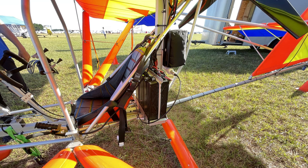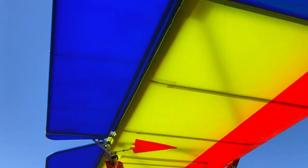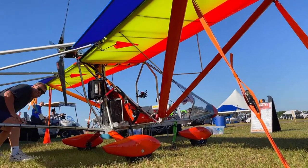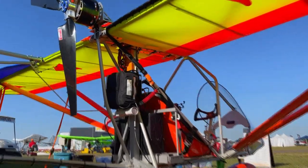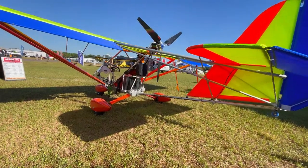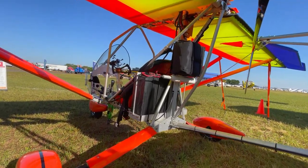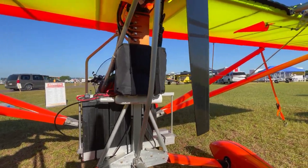We call them battery packs. There are three battery packs down there now. You can see there's a little space on one side — those are just some aluminum blocks holding space, because we took one battery pack out so everybody could see it rather than ducking underneath the airplane. The packs have a top bracket and they just sort of slide down in. All the plugs are up on top — kind of hidden by the parachute there. The battery packs sit into an aluminum tray permanently mounted to the airframe, with a retaining strap on top that holds them in.